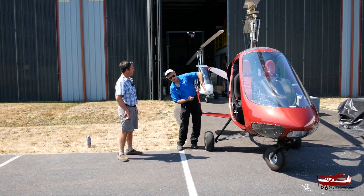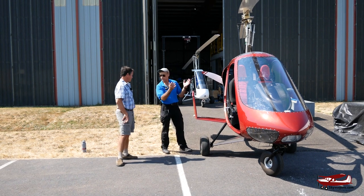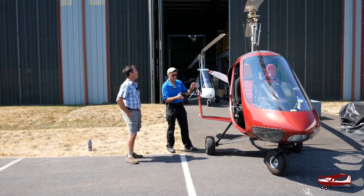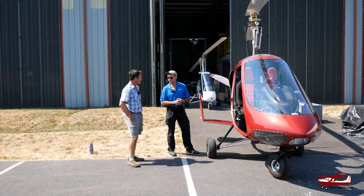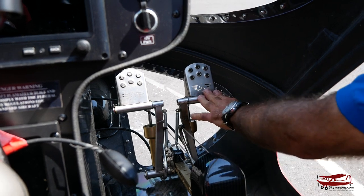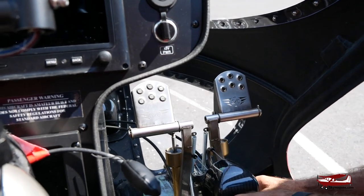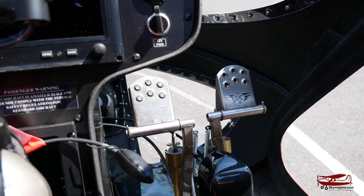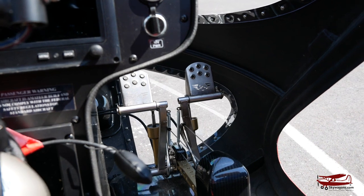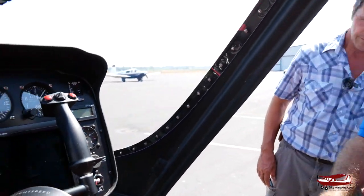So when we bank a hard turn, it's just dead smooth — it's really nice. There's a little bit of movement right now because of these big blades. That means less wear and tear, the nodes of frequency are smoother, and it makes everything last longer. I've been flying this really hard before we put any of them out. The adjustable rudder pedal rack — you have toe brakes, and you can simply pull this back to get way back here. Somebody like 5'2" fits them, and people all the way up to 6'6" — it works really well. Because the seat doesn't move; the pedals have to move. But it also gives us the proper angle for spinal protection.